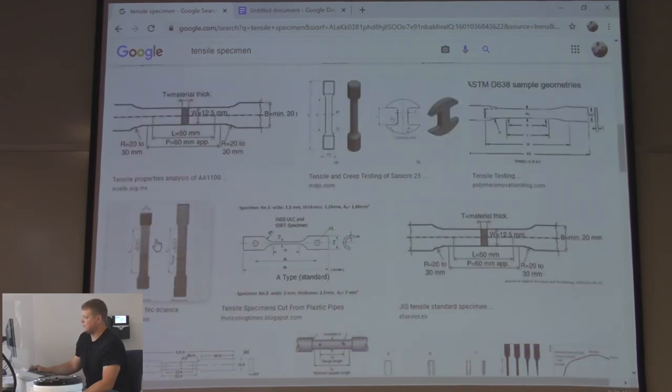With the mech tech students, they get these for different materials, so they'll compare the difference between cast iron, low carbon steel, aluminum. They're all the same size, just different materials. They don't care where it breaks. That's just a random specimen. They're going to look at things like percent elongation.